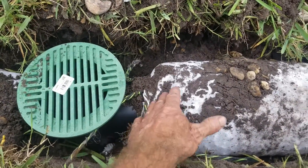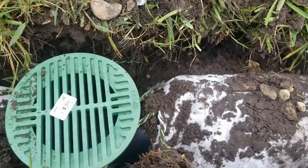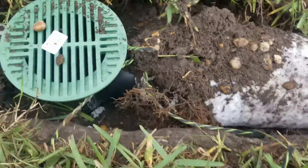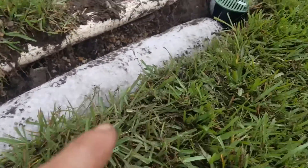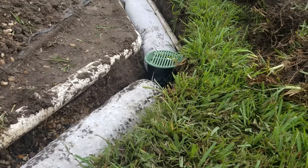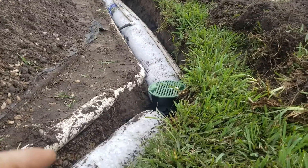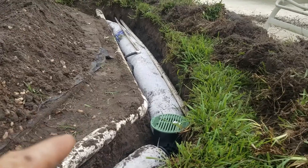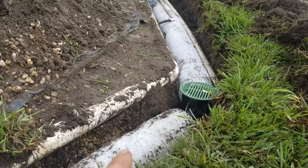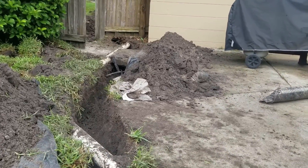We've cut the Easy Flow and tied the knot around the fabric to keep the peanuts from coming out. I like to throw a little bit of soil on top to help hold it in place while backfilling. You can see our line — I already put a catch basin there. We're going to extend that with a riser and bring it up to grade. It looks like it's going to rain — it wasn't supposed to rain today. Easy Flow is going to pick up the subsurface water as it rises, and the catch basins are going to pick up the immediate surface water runoff and drop it into our system — carried away to the sump pit and pumped out to the street.